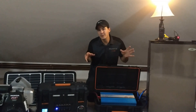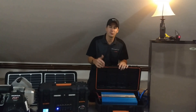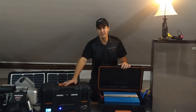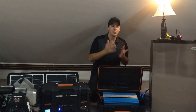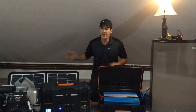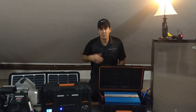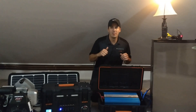I hope this gives you more information as far as how inverters work and how they can really be versatile in a utility-down or mobile situation as an alternative power supply to just running a generator all the time. You've got things to think about as far as capacity: how many loads do I need to run while the utility's down, how many batteries do I need, and what am I going to supplement with — solar or maybe a DC generator? You can start at the most minimal amount: just the inverter, some cabling, and go straight to your car. That'll get you through.